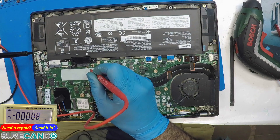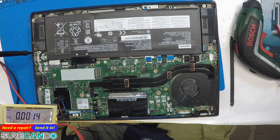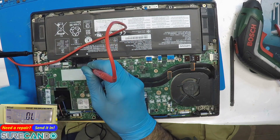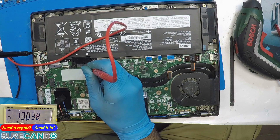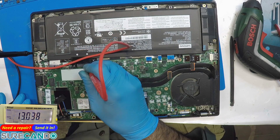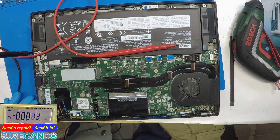That's the battery voltage, which is nothing at the moment. Now we're going to plug in the charger. Either it's a dead battery or it's going into a protection mode — see, no reaction there at all to the power supply. It's not increasing or decreasing if I disconnect. So basically the battery has stopped talking. We don't know the exact issue, we've got to try a different battery. I'll give them a quotation with all options, see what they want to do, and we'll go from there. Thanks for watching, see you in the next one.